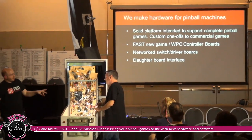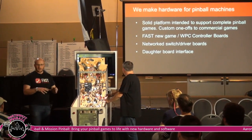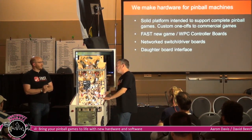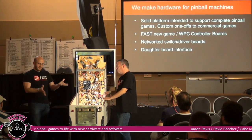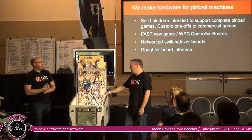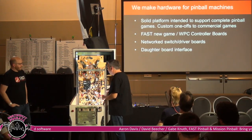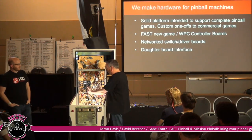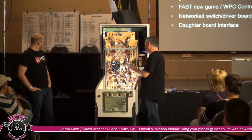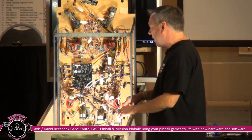The hardware is not just designed for tinkering — it's designed to scale up to a commercial game, to be robust, so that if someone wants to throw money at your original design and actually produce it, you don't have to start the whole process over again. It's designed to grow with you. We made it very modular — all the boards just plug into a daisy chain. Each board is very robust: digital inputs can handle up to 80 volts without damage, and all drivers have overcurrent limiting.